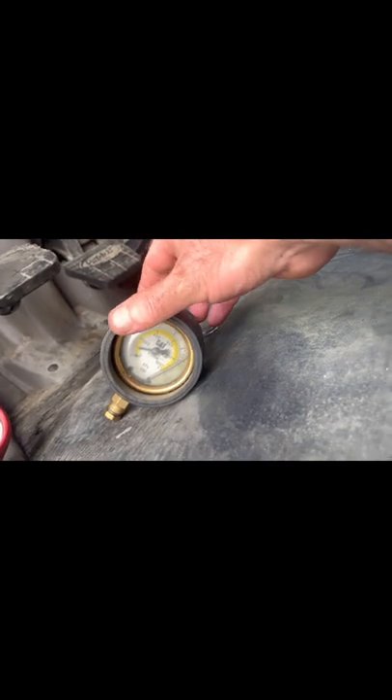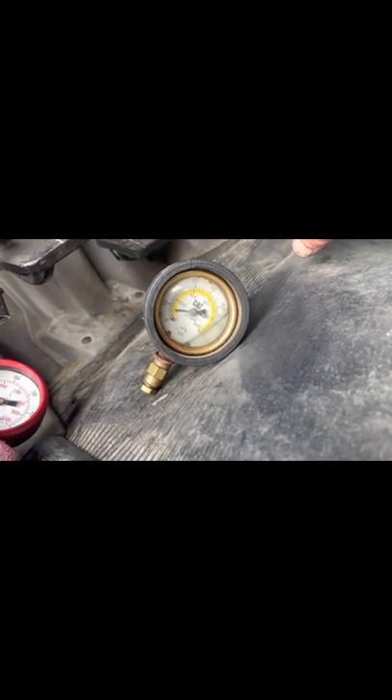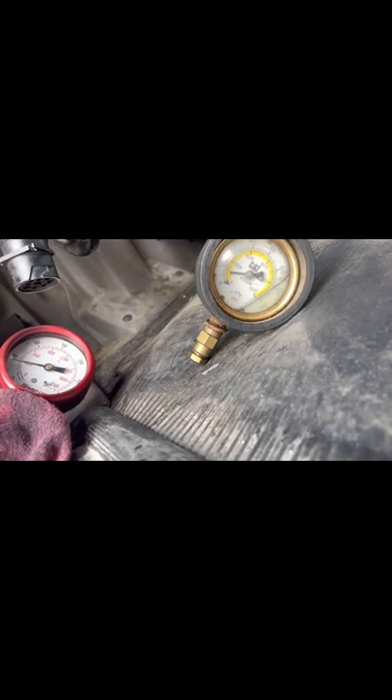The engine is running 10 times better — it's not hard to start anymore. I am in question of my Snap-on gauge here; that's my old faithful CAT gauge and as you can see it's not even hooked up, yet it's showing 14 PSI. I'll have to do a follow-up video on my new gauge when it shows up. Typically you want the C15 idling at about 65 to 70 PSI. So we're going to chalk it up to a win today from some clogged up fuel filters.